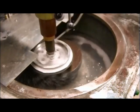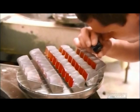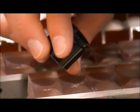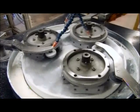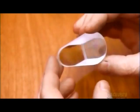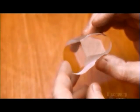Protective paint prevents any dust from contaminating the pristine surface. Grinding with diamond dust removes mere tenths of a millimeter of glass. Polishing with an even finer abrasive removes another one-hundredth of a millimeter. At the end of it all, the three sides are perfectly flat, which minimizes reflection — critical for making the glass see-through.